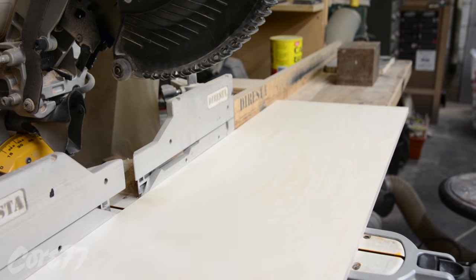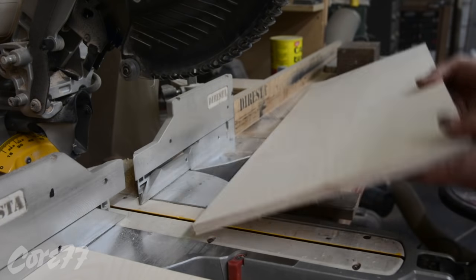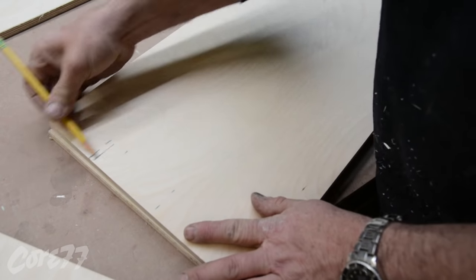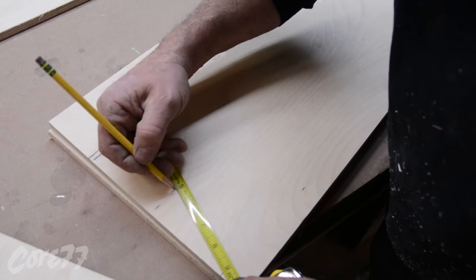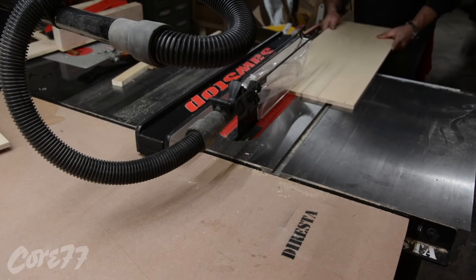Here I am cutting up some more of the wood. I'm using that big giant chunk of steel as my stopper — it works pretty good as long as you don't bang the wood into it. This is going to be the top bar or the front of the top tray, and I'm going to finger joint everything together. I wanted to make sure my finger joints fell cleanly so that there was a finger joint at the top and bottom consistently.